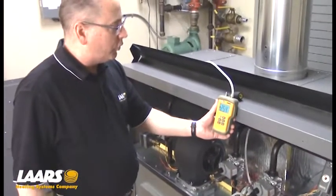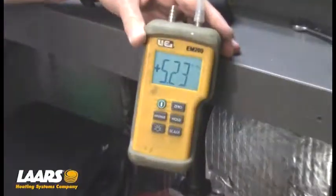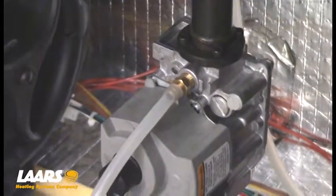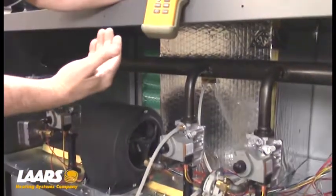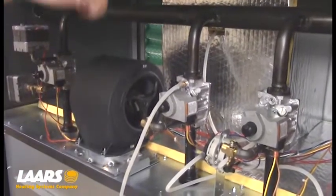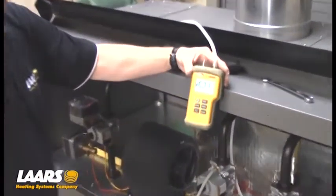With the last valve adjusted close to 2.5, we're good with the valve adjustments. Next we're going to put the plugs back in, hook up our combustion analyzer, and set our air shutter. Before buttoning up, you should also be checking the inlet gas pressure with all valves running. I've put my barb back on the inlet side — measuring now with all three valves. Prior to this we were running about 7.5 inches static gas pressure; this is running pressure with all valves running. Also keep in mind, if you've got more than one boiler in the mechanical room on a common gas line, hook up a manometer and check it with all valves firing. The minimum gas pressure is 4 inches, the maximum is 13.